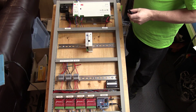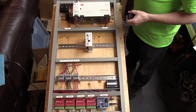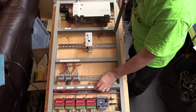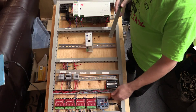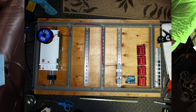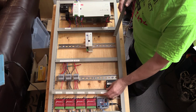I've positioned the camera high up looking down on the control board, which is sitting on a chair at a slight angle — so excuse me looking at a funny angle. This is the control panel I've wired for the CNC router. Starting at the top, some obvious observations: I've used plastic trunking, which comes in meter lengths and you can cut down to suit the sizes you want. This allows you to cable everything nice and neatly, keep it contained, and allows better maintenance in the future.